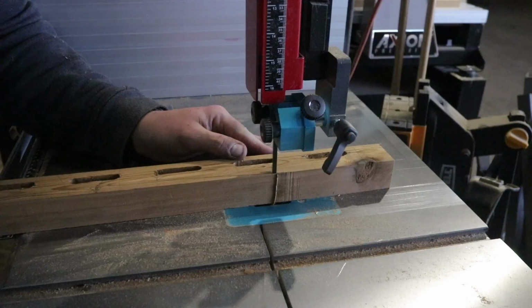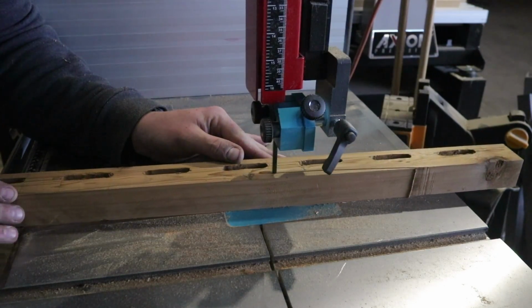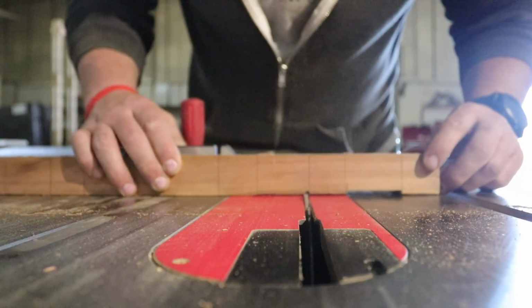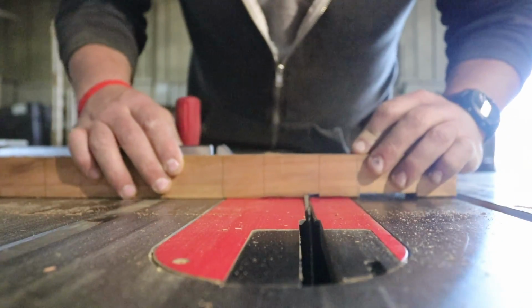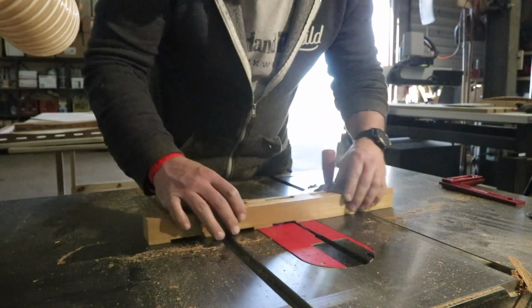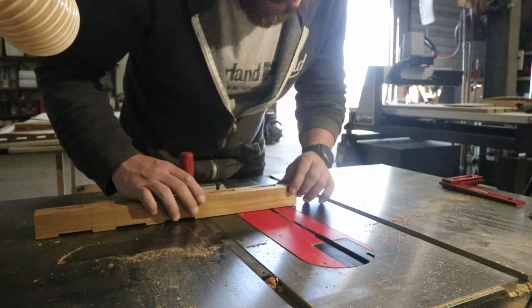Then it's moving on to the bandsaw to cut the curves in the front and back of each seat pan part. Using my miter gauge, I cut lap joints on the table saw so that the paracord has something to clear once it's rounded over the top of the outside of the seat pan, and it's mounted flush on the inside of the leg. This will make more sense once we get to that step.